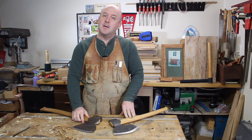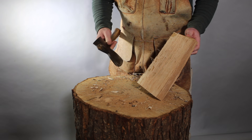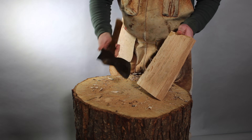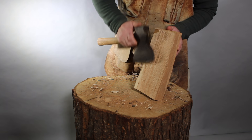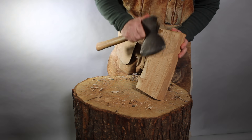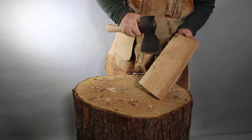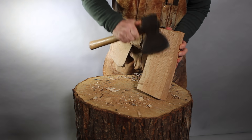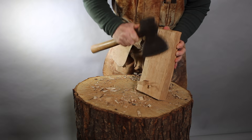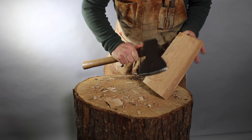I know this is dead simple, but it is the key concept in this video. Having an asymmetrical head turns the typical broad axe into a specialized tool for creating a flat face. You can think of this flat back as akin to the flat back of a chisel, which is going to follow along a surface to allow you to do paring. You might make a few scoring cuts like this in order to help the blade get down to that surface, but what you're doing with the broad axe is creating a nice flat face.